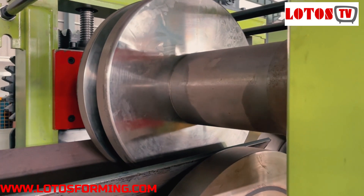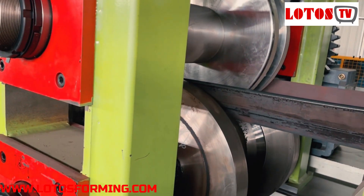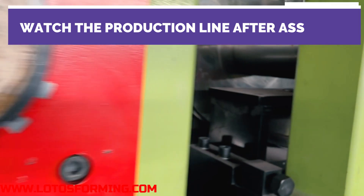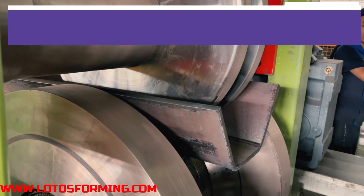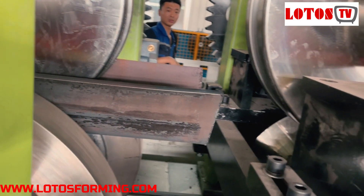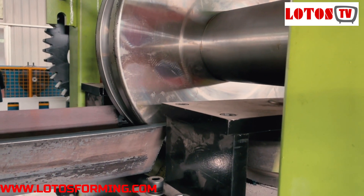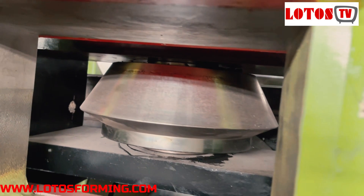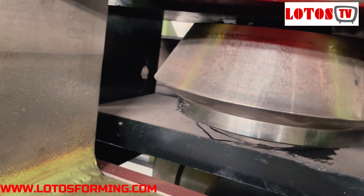The roller is very big — the diameter can reach up to 700mm. Here is station eight, and we can see the angle just forming up, about 60 degrees, well formed. Eight going through to nine. In this rolling station we have a side roller — a vertical roller moving along the side of the groove, along the surface groove.